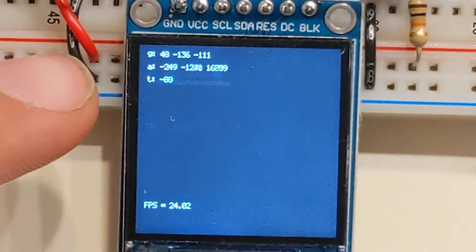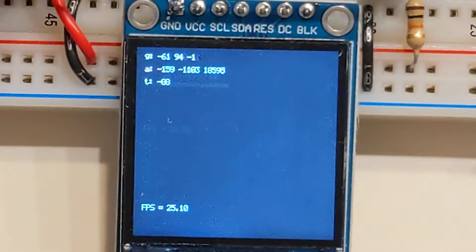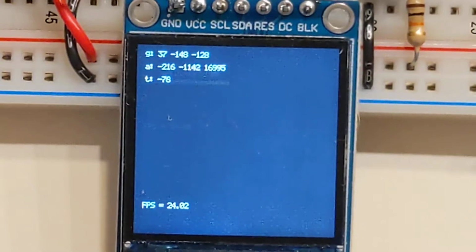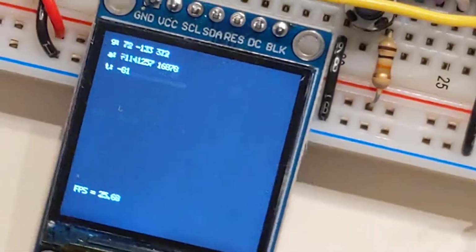So at 24 hertz, we're reading the gyroscope, the accelerometer, and the temperature value. If I touch the chip, you can see that temperature value change. Still have the equation that brings us from whatever this value is to the real temperature. The gyroscope is basically reading zero, a lot of noise, and if I rotate...